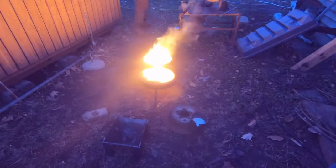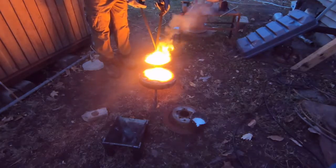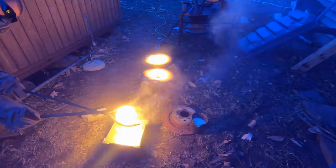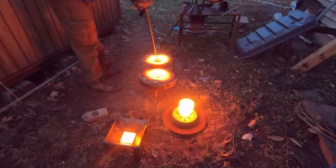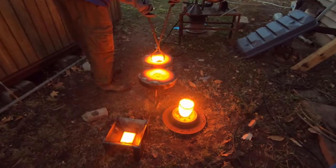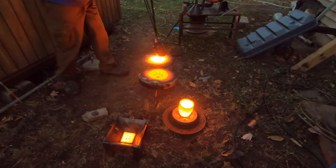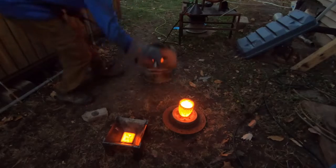This is the A3 crucible coming out of the pits of hell. There is some smoke coming off this stuff, probably from the flux for the most part, or maybe volatile oxides. When the furnace is running, the smoke is diffused so much with air that you just can't see it — it's thinned out too much. I'm also having some trouble — this crucible broke on me and a large piece got lodged underneath it. I didn't want it leaning in crooked because it messes with the turbulence inside the furnace.